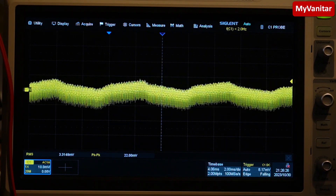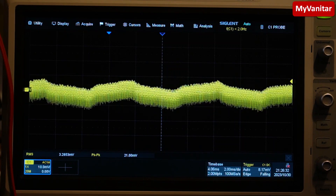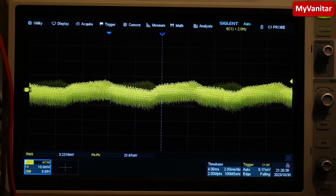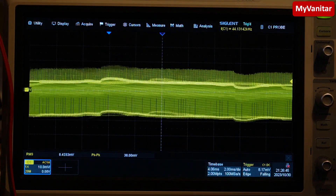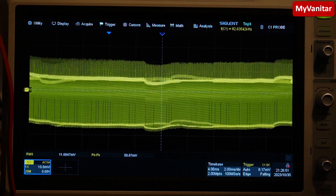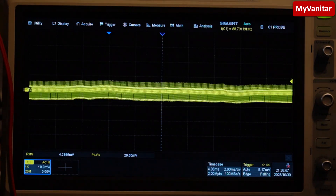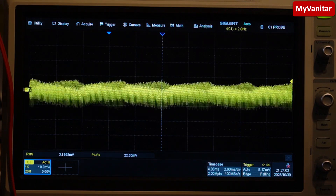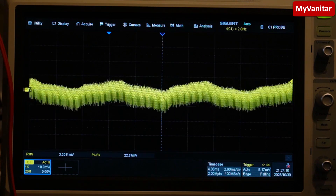The noise is even lower than 20 millivolts peak-to-peak — the actual noise is lower than this because the probe absorbs some environmental noise from the switching transformer. Let me show you: this is the switching noise when I put the probe near the transformer. Of course it doesn't happen under no load, but when the transformer is under some pressure the switching noise is more evident and more powerful. This is the output noise under maximum load. I hope you like this video — don't forget to share and subscribe, see you in the next video.